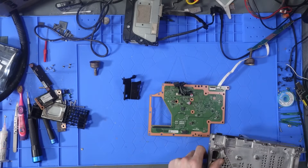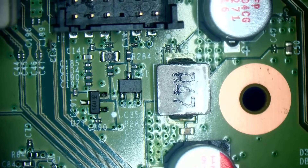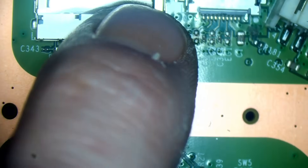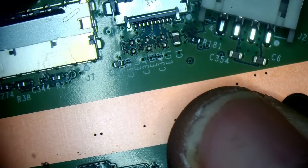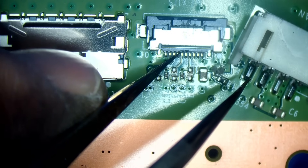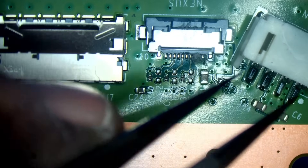Now I can run through voltage rails on the safe bridge board to figure out the issue. The good thing about this V1 board is that it has markings — for example, '3P3 FTDI' is labelled, whereas V2 boards aren't marked. I'm also going to check inside the Nexus connector since it's been opened before, just to rule out any damage — and that looks absolutely fine.